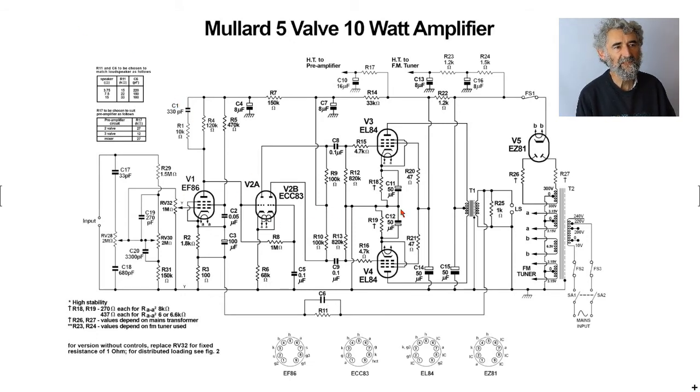The phase shift within this circuit is very, very small, particularly if it's well built and there's not much stray capacitance to shift the phase at high frequency. But it is the inductance here, and you might think a few millihenries, why does that matter if the transformer has a minimum inductance? I'd have thought that they would specify 25 henries, preferably 100. It may be a huge ratio, but the phase shift caused by the leakage inductance, which is not coupled into the secondary, does cause a very significant phase shift at high frequency.